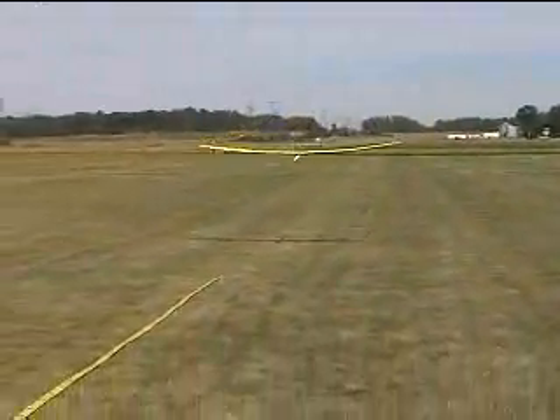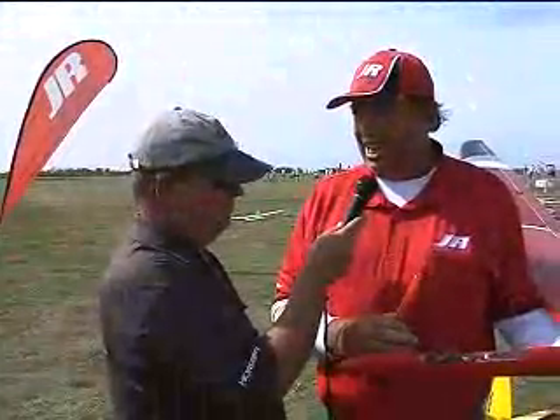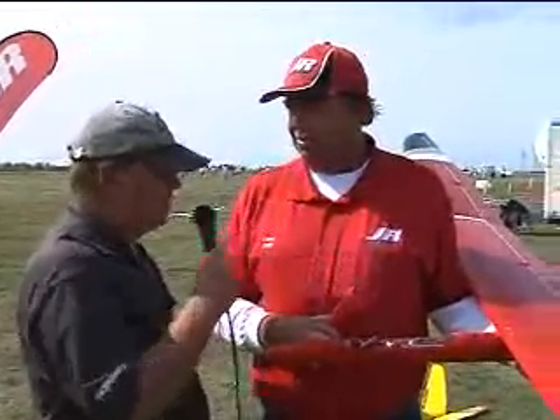We see when we have a hold, but we don't know whether our receivers are getting blocked — and that's the biggest thing for us, to really optimize that antenna installation. That's something you certainly couldn't do when flying 72MHz. Back then I'd just automatically lengthen the antenna and hope for the best. Now we can really optimize the antenna solution.